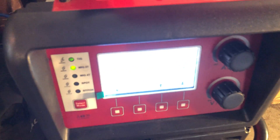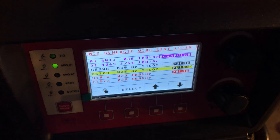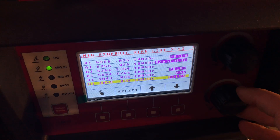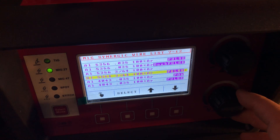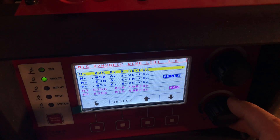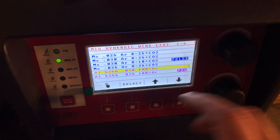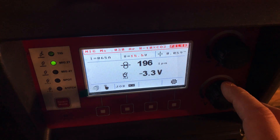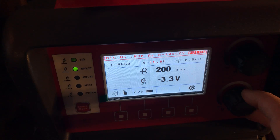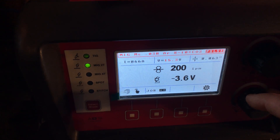Here's a couple of settings just for you guys to see. You've got silicon bronze, stainless steel, aluminum, the new Ford aluminum 5554, and then all the way up to mild steel — 25 or 23, whatever you use. You can mess with it too — if you pick a program you can select your wire speed and your voltage. That's what I did: I took three volts off even though I put it at 200 inches per minute. That really helped me save from burning through.